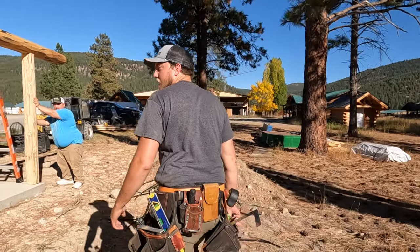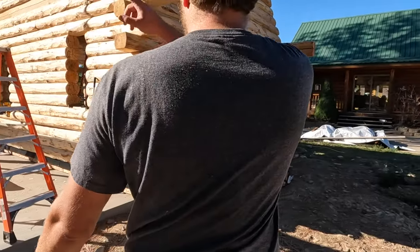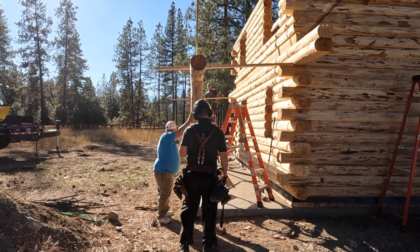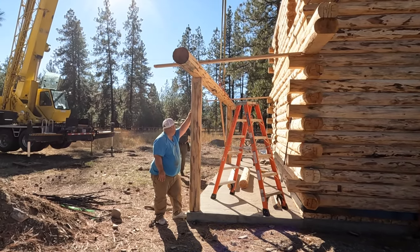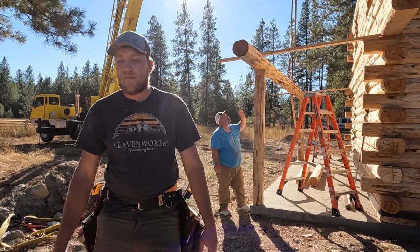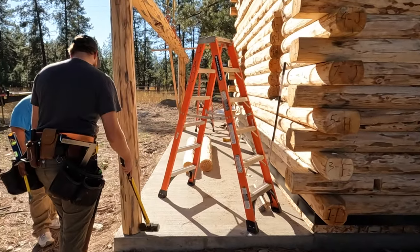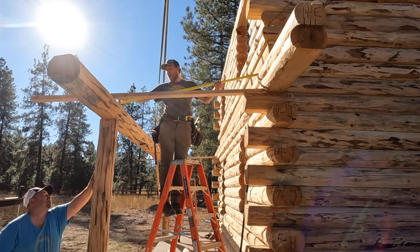Okay, we're going to do the same thing over here. Pretty good. Now just one more brace up to there. Let me measure this. The line, we got 70. This post is a lot bigger than that one, so this is going to be out to the edge, but that side needs to be, you know what I mean? Yeah, I got you. I'm an inch from the edge here, but it's 2 inches bigger than this side. So I actually want to be like an inch. I mean, it looks pretty good. I know, but what I'm saying is, this end is out, the top's out. So we actually want to bring this in. That's about where it should be right there, I think. And then we'll pull it in just until it's straight. Yeah, a lot. That's pretty close now.